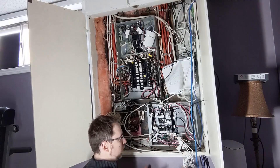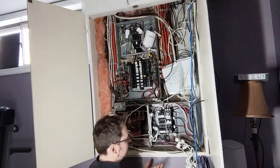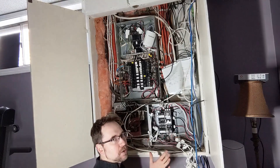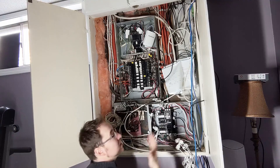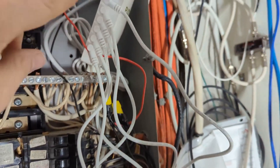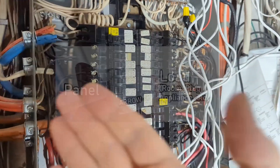I now have all six solar wires monitored with the 'L' oriented toward the breaker. The downside is I've used six of my 16 monitoring ports on the Emporia, so I'll have to pick and choose which other circuits to monitor. I've connected these as numbers one through six on the hub — I'll remember that one through six is solar — and then I'll continue hooking up the remaining monitors for the home circuits.